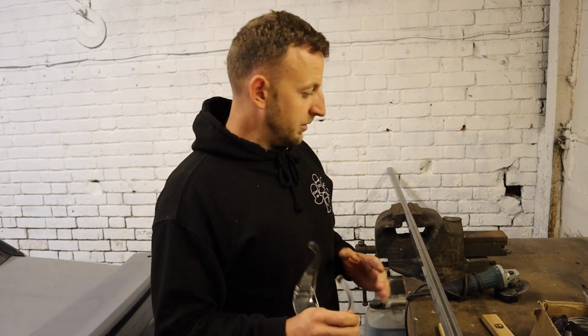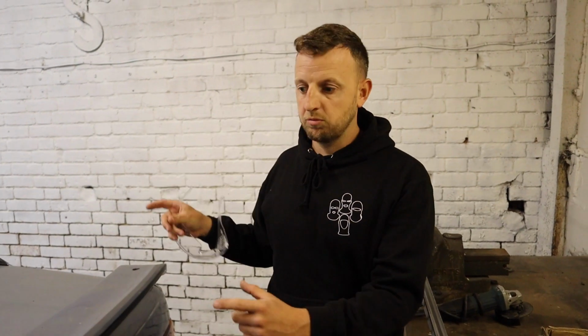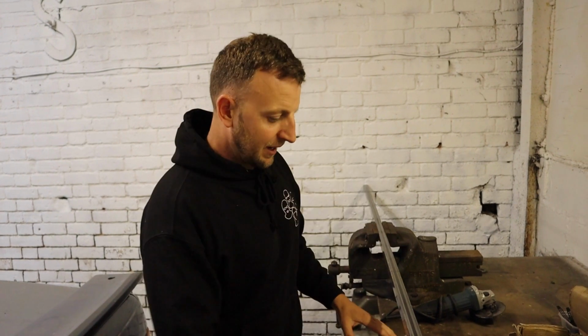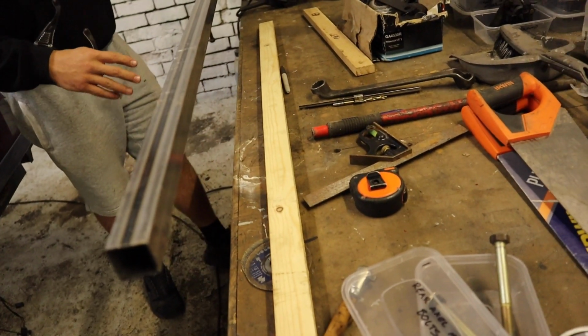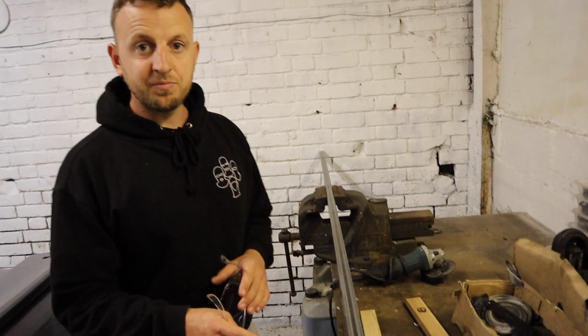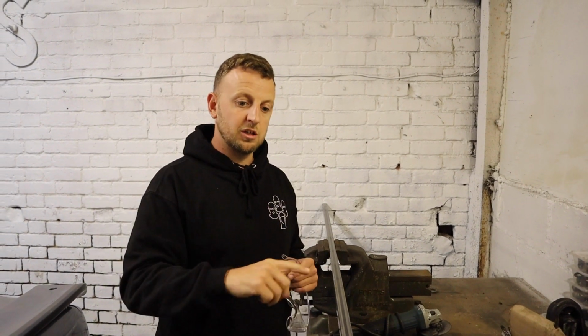So, we've gone over to the rear axle to get it all squared up in the right position. I've made a pattern out of timber, which all seems to work. I'm going to now make that out of metal, and we've got the other shell, which we're going to tip on its side, get everything bolted up in place, and then we can tack this into position and bring that over to this car.